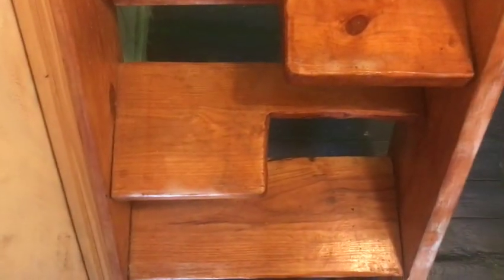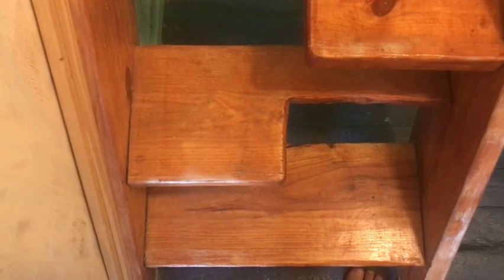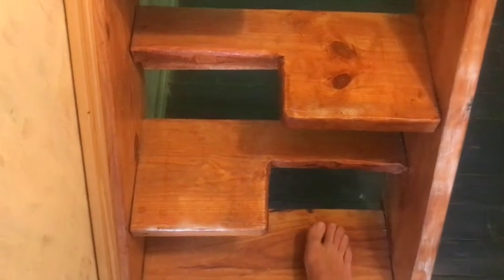I would recommend cutting the notch from the top of one stair to the end of the step below it, basically at the halfway mark. This gives enough room for a full foot to step up on the stairs. If this notch wasn't here, there wouldn't be enough space — the wood would be in the way. That's what makes the alternating tread stairs even more safe than regular stairs.